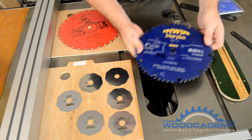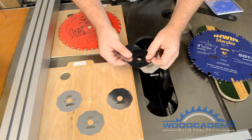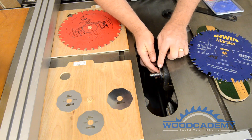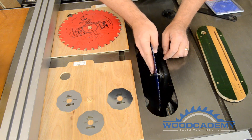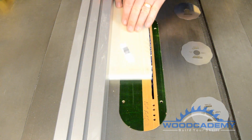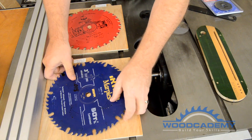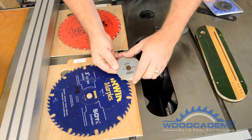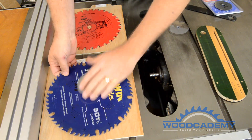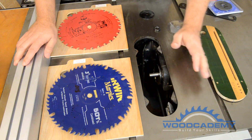Once I've figured out that this blade is 18 thousandths of an inch different than my widest blade, I choose the 10, the 5, and the 3. One thing I've figured out: put your thicker shims on the outside and any thinner shims on the inside — it makes sliding them onto the arbor easier and they're less likely to get caught in the threads. Then I lay the blade in place behind the arbor shims and secure it normally. If you only use a couple of different blades, I actually take the shim stack that goes with each blade and store it with that blade, so the next time I just put the shims on the arbor, install the blade, and I'm ready to go — it really adds no extra time to blade changes.